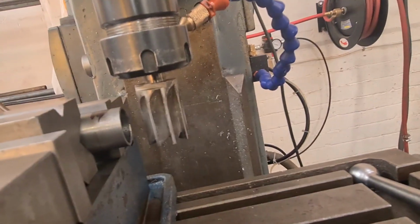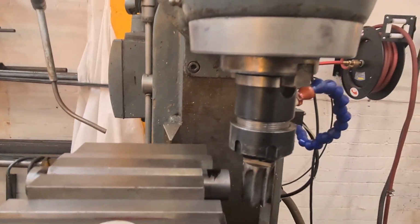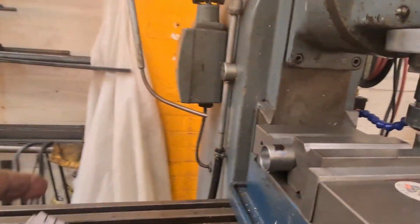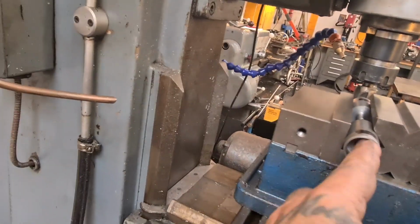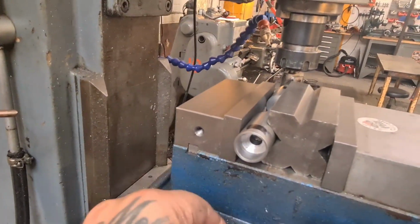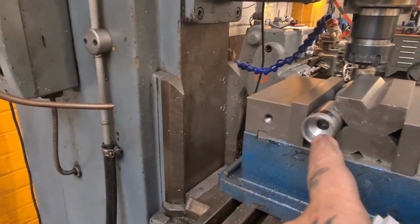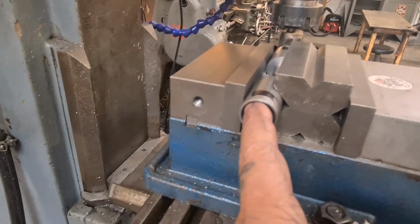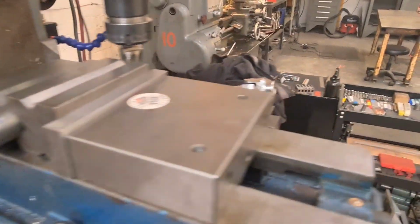I'm just going to keep it at depth, look, to make a cut and wind it in. We're going to go 10mm, I reckon. Near enough's good enough. That'll give us a relief still for welding, so we're not welding inch solid where my seat's going to go. I'm going to weld it onto the thinner contour diameter, look, thinner wall. My words. Get your words out, Ralfy. I know what I mean.